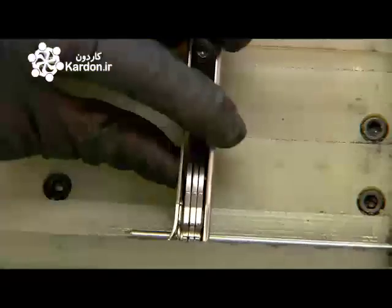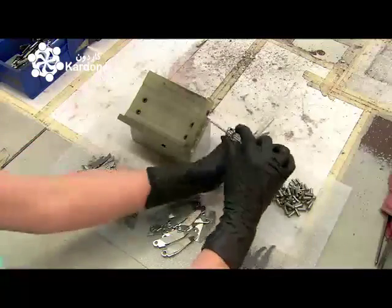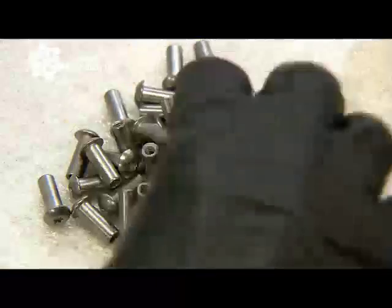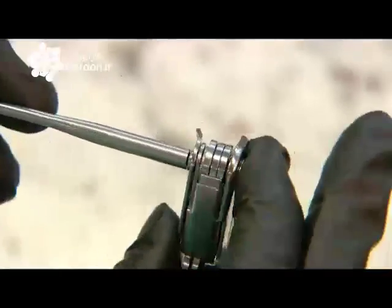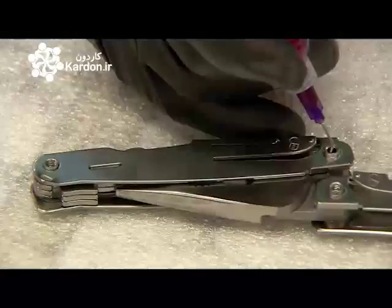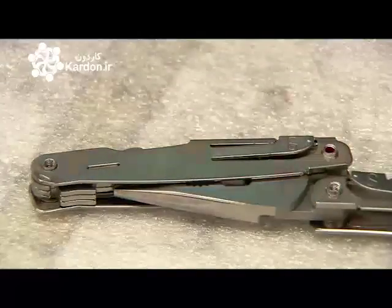In assembly, they thread a rod all the way through the holes at the base of the handle and tools to hold the alignment just until they secure the setup with a stainless steel pin and rivet. They repeat this process in the other handle with the remaining tools, except for the knife blade and scissors, which will go in later. They apply a few drops of thread lock to immobilize the pins in each handle.